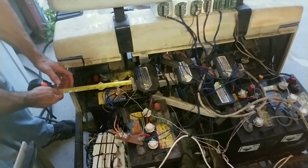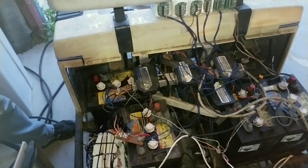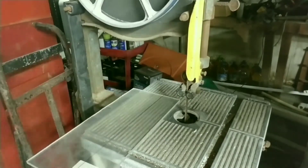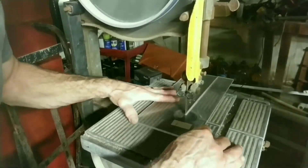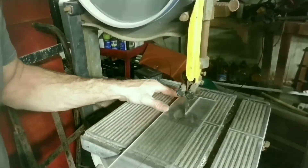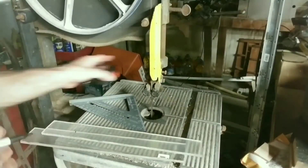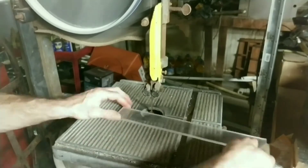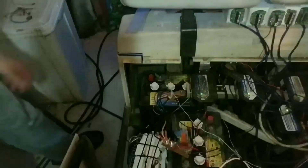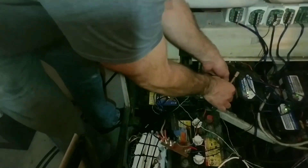So what's the golden rule here? You measure twice and cut once, right? I did find some plastic in my pile and I don't know what it was — I wish I did. I've gotten some acrylic recently and it did not cut nor drill like this stuff I used on the golf cart. I'd like to go back and find out what that sticker says. This stuff that I used was probably Lexan. It drilled nicely, it cut nicely, it didn't crack or break or anything else. Some of the stuff I've gotten recently does.